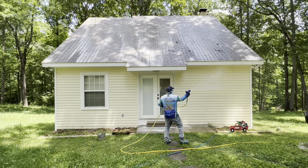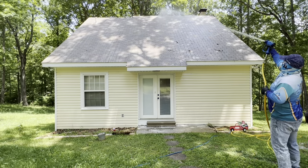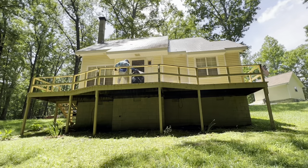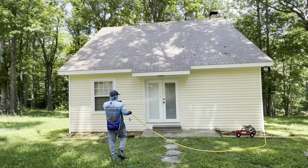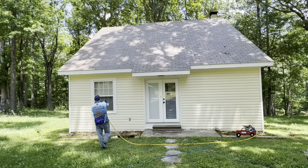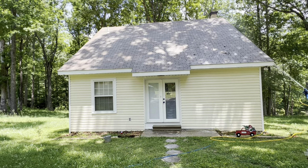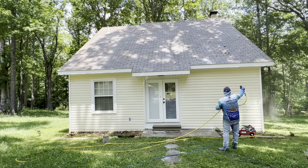In this video we're walking you through how we do the roof wash, house wash, and concrete wash on a multi-location property. This is a multi-project job — four locations, and this is the fourth. This one has a house, two shops, two concrete areas, and a porch. We're hitting the roof with about a 3.5 to 4 percent SH mix. We have a cling-on in it, which boosts the suds and helps the bleach stick to the shingles and do their magic. This roof was very nasty. We wet all the plants first, then laid the roof mix on top and let it set, then slowly worked our way down the house.